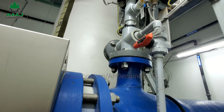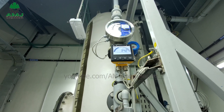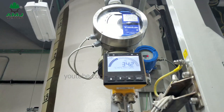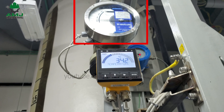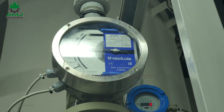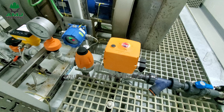After the cell, another temperature transmitter is installed. If the temperature of the biphasic fluid increases over the set point, a malfunction is announced. A flow switch is set to detect both low and high flow. If either set point is reached, the system shuts down by closing the root motorized valve. Low flow indicates partial blockage of the electrolysis cell or insufficient flow due to filter blockage. High flow indicates excessive inlet flow, resulting in lower sodium hypochlorite concentration than necessary.